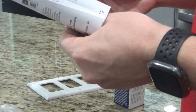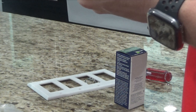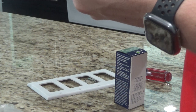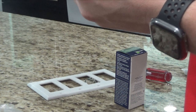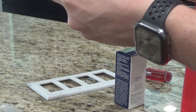So they show you the wiring guide of one smart switch and one normal switch. You tie it to the traveler wire, and it looks like you need to put your smart switch on the load side. So I believe that's going to be my other switch that I haven't taken off yet.